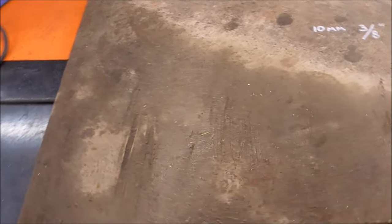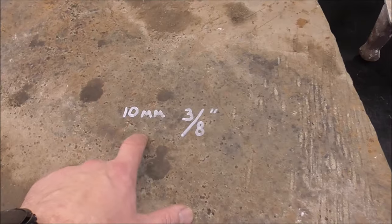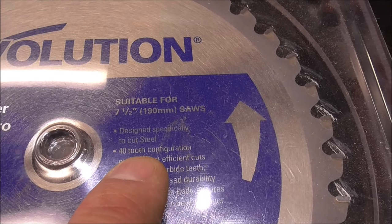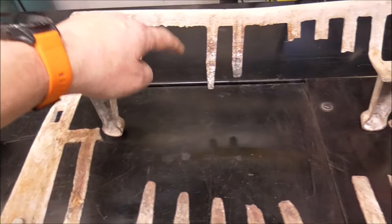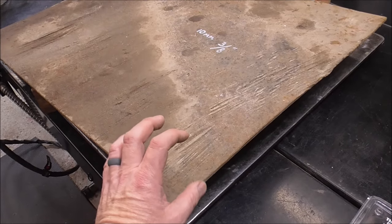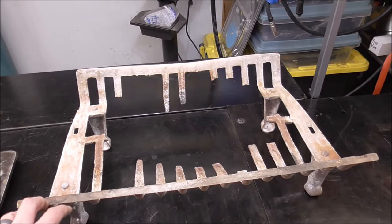The way this works is that these used to come all the way across, all connected from side to side. What happens is over time, this gets used and it glows cherry red. Because these are cast iron, all the heat and cool cycles eventually cause them to break and fail. I've got to replace this about once a year, and they cost anywhere from 40 to 60 bucks. So I've got some scrap plate — this is 10 millimeters thick or 3/8 inch — and I'm going to cut a piece to fit down inside here. I may even double this up, which would be three quarters of an inch thick, and we'd probably never have to worry about replacing it for two or three years.